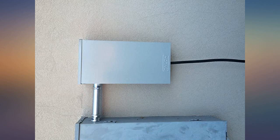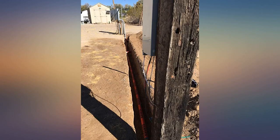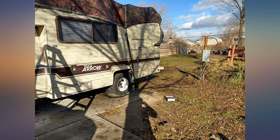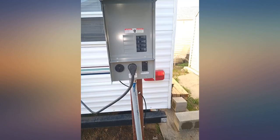I bought the outlet panel for my EV cars. It comes with NEMA 14-50, NEMA TT-30, and GFCI NEMA 5-20 outlets and 3 corresponding circuit breakers. There are spaces for 4 more breakers, so I added another one to control my garage door.